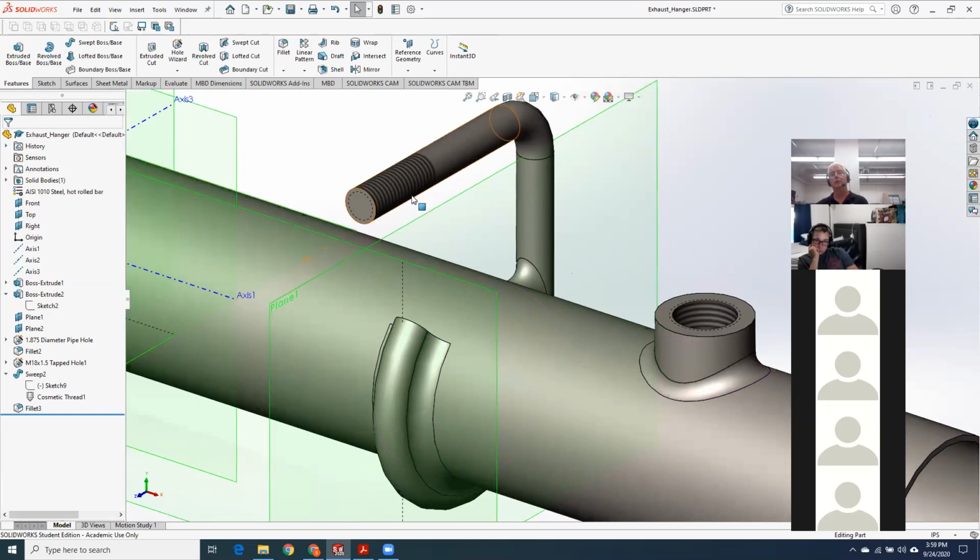That was what I wanted to see on it. The other thing that was kind of the giveaway on that one is if I had drilled a 3/8 hole into this 3/8 shaft, I would have seen the dimple of a 118-degree drill bit right in here. Because you didn't see that, that should have told you it's probably on the outside.